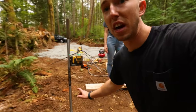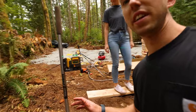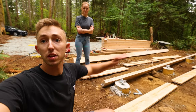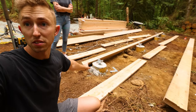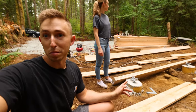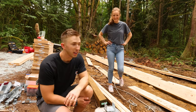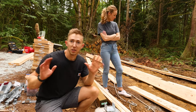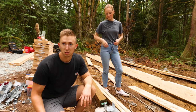What I've done is taken the stomper we use for patting down before we set the piers and set the laser on it. With the laser set on this post it creates a perfectly flat plane, so all we do is take a tape measure and measure up from the base of the plate — that'll give us a perfectly level plane for setting all the beams. Emma also pointed out that it almost gives it treehouse vibes when it's a little higher up, which could be a nice plus for Airbnb if you can list it as a unique treehouse-style property.